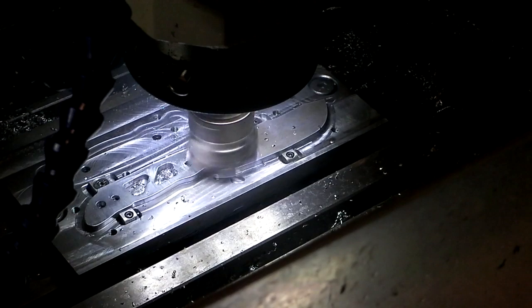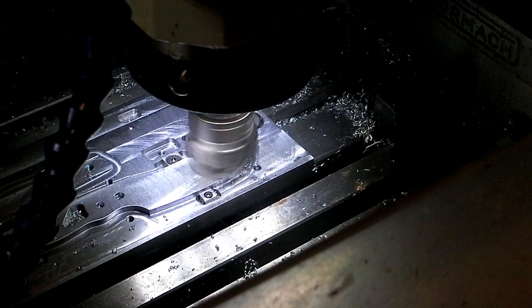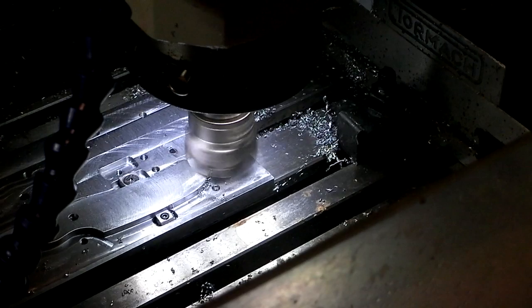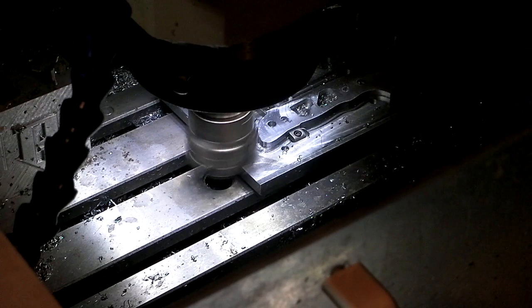Purposely not using any coolant just to see how it works. I see a lot of smoke coming up just from the oils and stuff burning off. A little bit of heat's okay on steel though. So that was the first pass, and then I'm going to do another pass, with a slower feed rate and faster RPM, just to see what it does. I'm trying to get a nicer surface finish than that. Although that's okay, but...